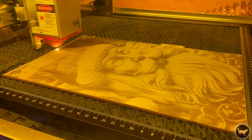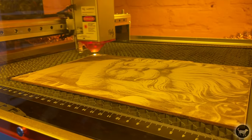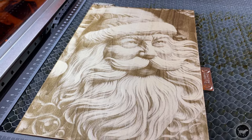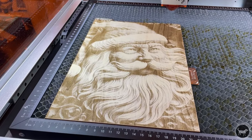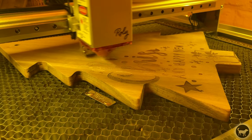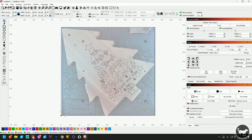After that, I wanted to do a longer image so I ran this Santa image I had purchased off of Etsy on some of that same bass wood that I used for the cutout job. This time I utilized the honeycomb to set up the job so it would go to the exact borders of the wood. Now one thing to bring up here is that when engraving all the way to the very corner of that zero-zero coordinate position, you may run into an issue where depending on your overscan settings, you might trigger the hard limit switches when engraving, specifically at the faster speed. The way I avoided that was to shift my image over by 20 millimeters. This still allowed me to accurately position my wood to work with the absolute coordinates and it engraved really nice. I even hit it with some colored pencils afterward to really make it a nice item for Christmas. The final job that I ran was another cutting board — this time so large that it didn't fit straight into the machine, so to be able to engrave fully on it, I really needed to utilize the camera to position my work on the machine.